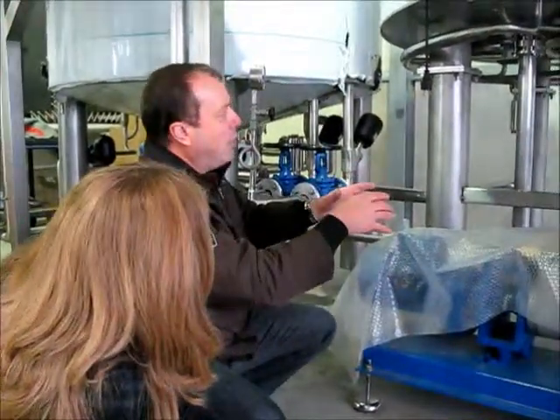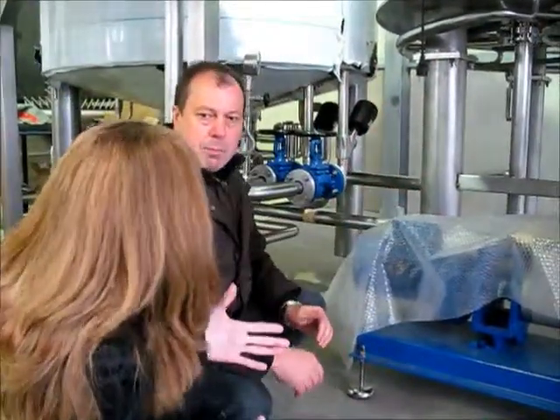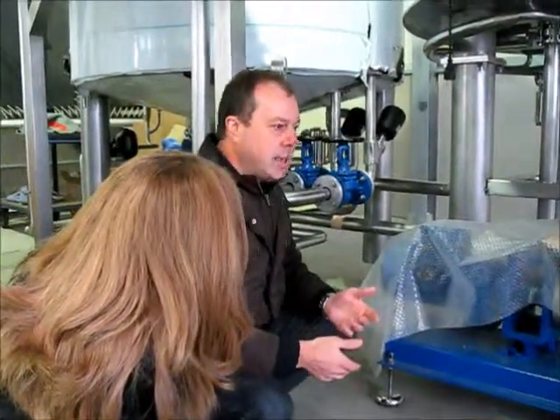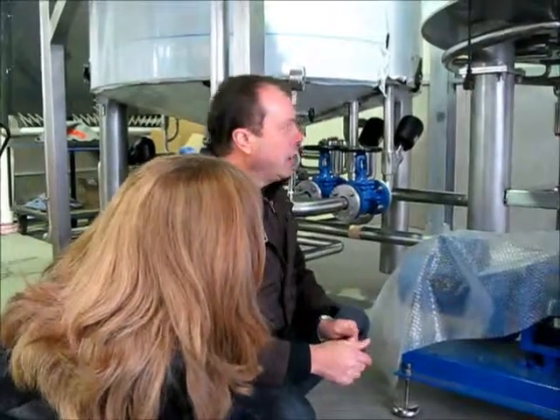If you would have only one central outlet, you would have more water flow through, almost like cones in the middle where it comes out. So your brewhouse yield or your efficiency is lower compared to a system where you have more outlets and you collect and work evenly.